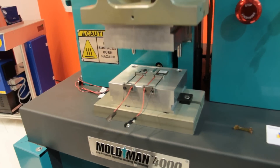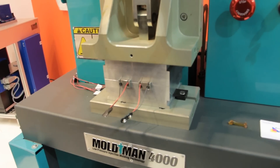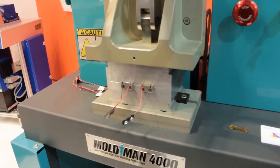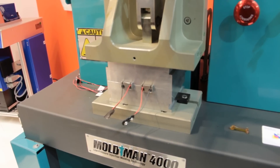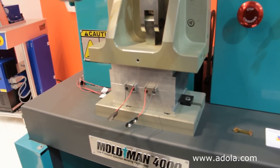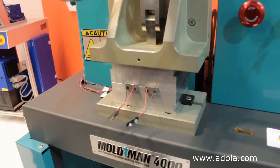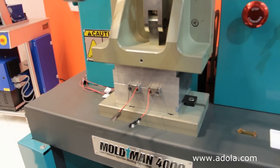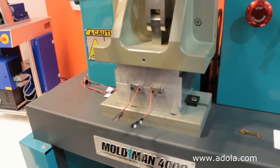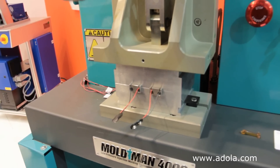I then bring the machine down, which initiates the process of low-pressure injection. We have material coming in at 223 degrees C at a very low pressure of 5 bar, which is about 100 psi. It's going to be injected in with a screw pump for 15 seconds, and then we're going to have a 15-second cool-down period, as you can see on the display up above.